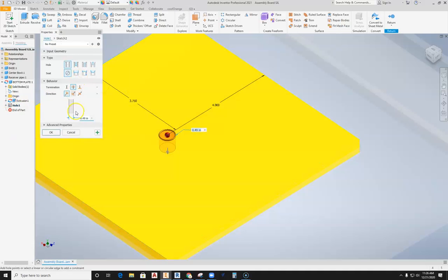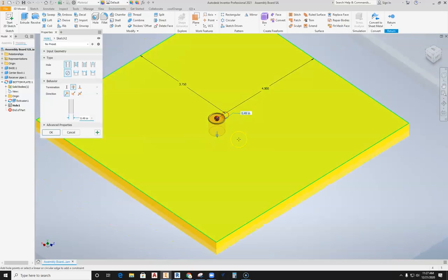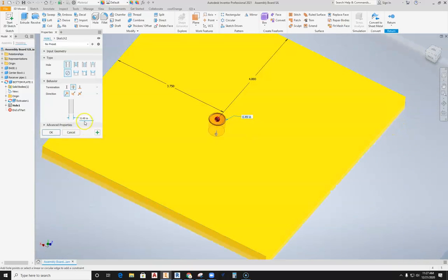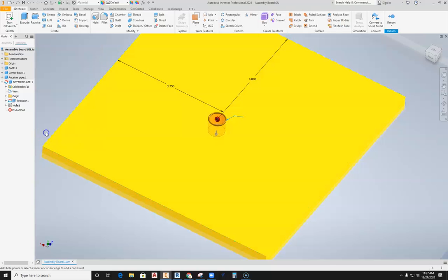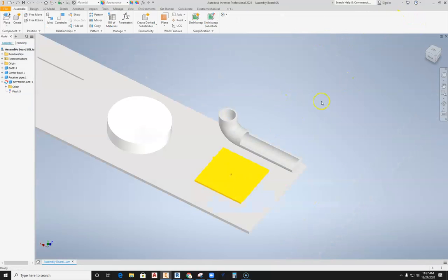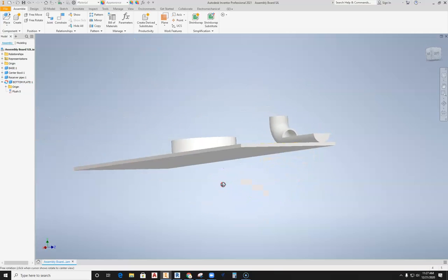Sketch feature, edit feature. How big was the hole? I'm going to use a shaft that is 0.5, and the hole is 0.49. Is that going to fit? That's not going to fit. Let's make it 0.51, or let's do 0.52. I know the hole's a little larger than the shaft, but it should be snug. All right, we'll hit OK. So that's set. Now we can just keep building, hit return, and start the next part.